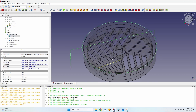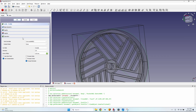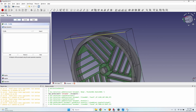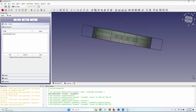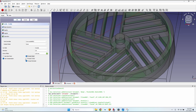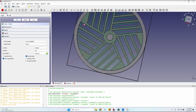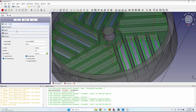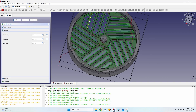I'll modify the radius of this circle to 199.99 millimeters. Close the sketch — there's still a very tiny rim, but I can select this face and the entire face is now selected. The profile path is messed up because changing the sketch renamed the faces — this is the topological naming problem. Double-click the Profile, go to Base Geometry, remove the geometry, select the face from the bottom — it's very important to select from the bottom. Go to Operations, click Process Holes, uncheck Process Perimeters, click Apply — now all the milling for the holes is exactly as it should be. Select the top face, go to Depth, click the arrow next to Start Depth, click Apply — now everything is exactly correct.